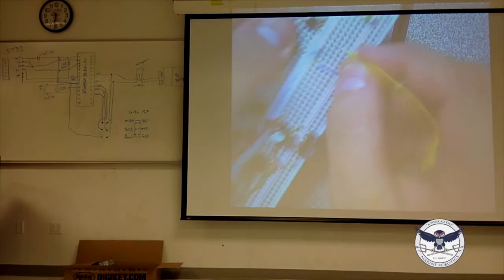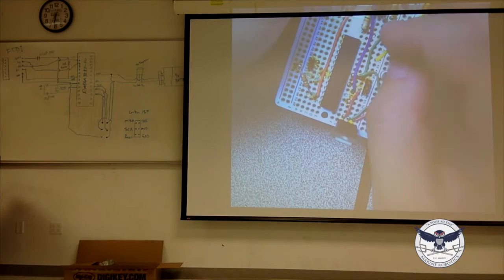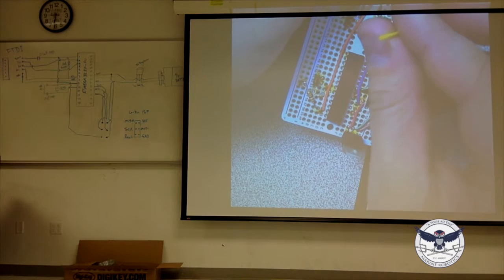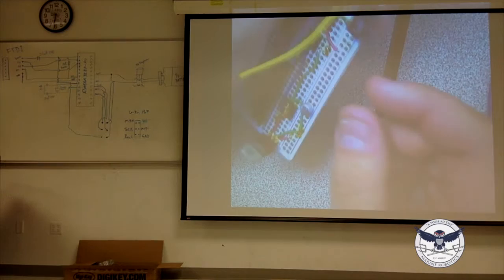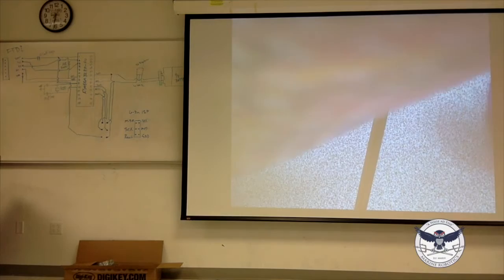You're going to be taking the wire and moving it to the location it needs to go. Maybe you need to get from this location all the way back to the ATmega328, which is the processor — really it's a microcontroller — we're going to be using tonight. You strip the other end of the wire and then put it on the pin. It's just like using a breadboard, except you have to solder.